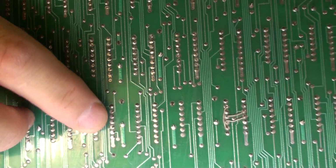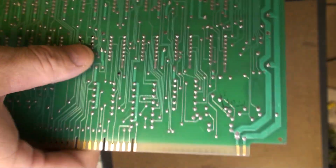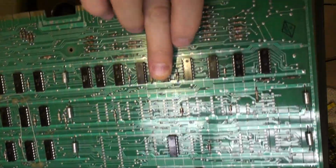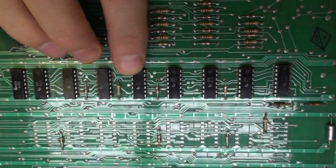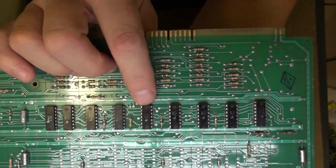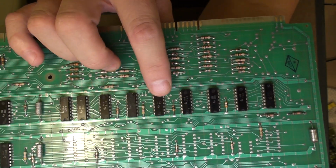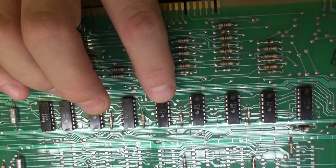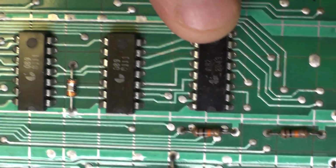So the real question is, what are these chips? Well, let's start with the one that has 5 of the 6 connected to it, and we flip that over, and I just have my other finger on it right here, and voila, it's this chip right here. Well, what is this chip? It's not particularly obvious, because we have the row of chips that appear to be pretty identical, and these are clearly 7400 logic chips, but which ones? Well, these are all Data General Nova numbers, right? So if this is the one that we're targeting, you tell me. What do we have here?